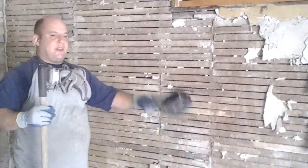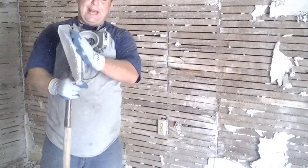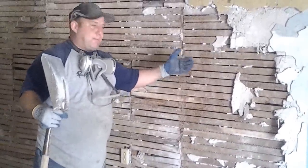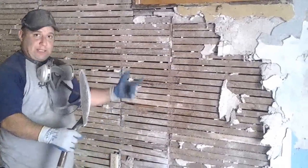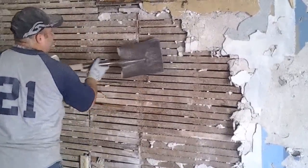As I was knocking down the plaster, the reason why I use the shovel is because it spreads the impact over a longer area, breaking the crack that's held on. These grooves here that are holding on — it breaks the surface away from the back, so it falls off in pieces. And what doesn't fall in pieces, as you can see along this stud, can come straight off very easily.